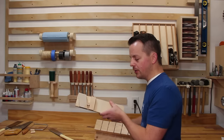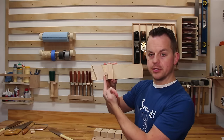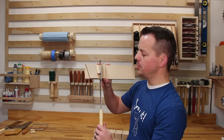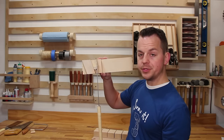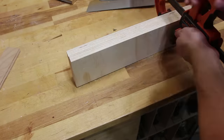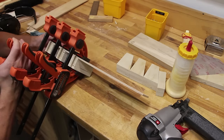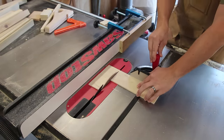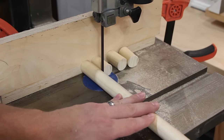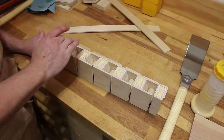Let me show you how this works. There's a little floating dowel and a piece with an angle on it. As you take your saw and put it in, that dowel slides up, and when you pull the saw down the dowel slides down and holds it right there. I started by cutting some quarter inch plywood as the backer, then glued two pieces of three quarter inch plywood together and cut them into wedges with an 18 degree angle on one side. These were glued in place on the backer board. I then cut square pieces of quarter inch ply and glued them to the front to keep the locking dowel in place — making sure to leave a gap for the saw blades. Each dowel was cut and sanded to fit almost exactly to the length of the slot but loose enough to still roll. Once I confirmed everything worked, I glued the top pieces on very carefully so I didn't get glue on the dowels.